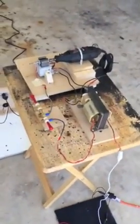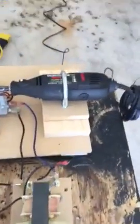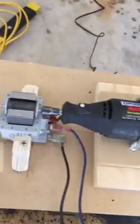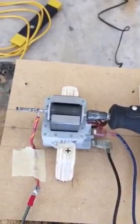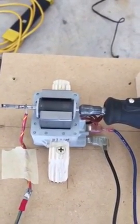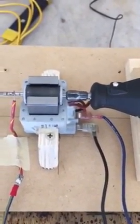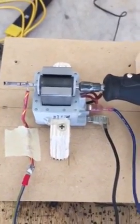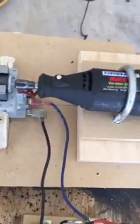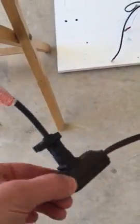Here we go, I'm back at my little experiment. We're still playing around with the Dremel that is chucked into a permanent magnet north-south in an iron core. The gray box surrounding the core is just a coiled wire from a washing machine or dishwasher — some appliance. The Dremel is being powered off house power via a brown extension cord, and I wanted to make sure I was separate from the house ground.